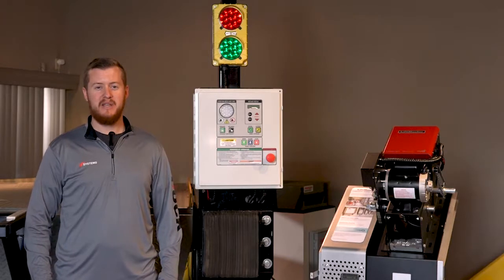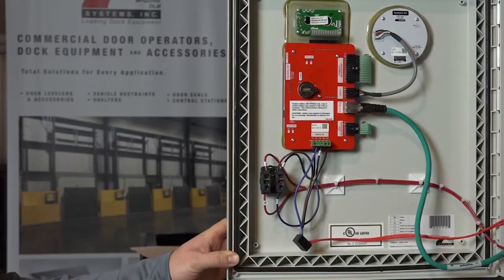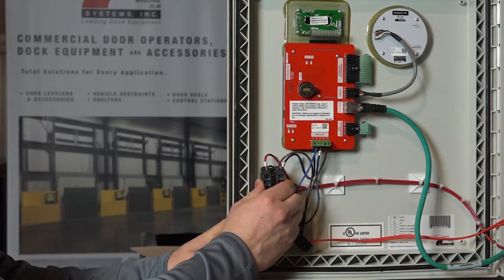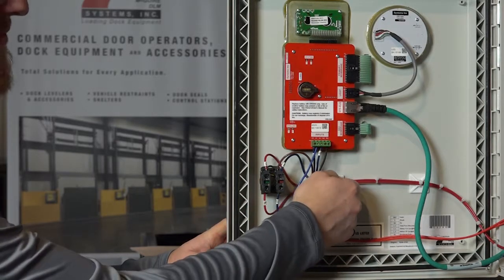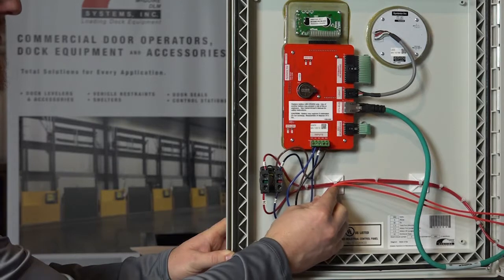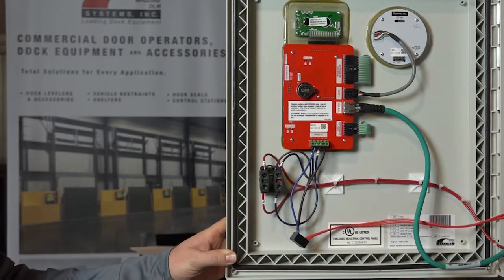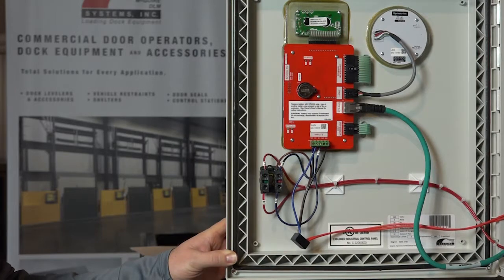When the wiring is complete, use the mounting bases and cable ties included in the kit to ensure that the finished wiring is neat and does not interfere with other control box components. If you're installing the L5 interface kit with a unit that has options like the emergency stop, remove the zip ties from the mounting bases that already exist and connect your MAS wiring to those mounting bases for a clean fit. Otherwise, use the mounting bases included with the kit and install your wires in a similar fashion.